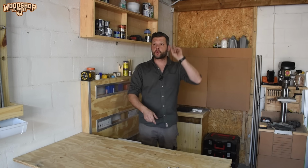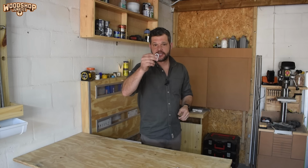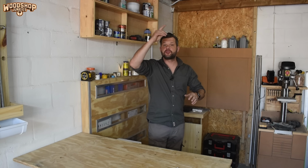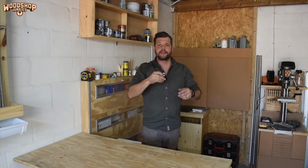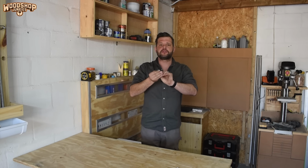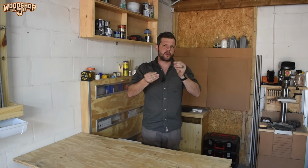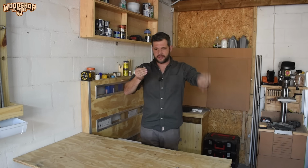To tie the extension cord to the overhead support system, I'm going to use these mini carabiners. So I'm going to add, let's say, 6 or 7 to the overhead steel wire rope, which will be able to slide up and down. Then every, let's say, 800 mils of extension cord, I will tie it to a carabiner with a zip tie or cable tie. So I will make an 800 mil loop, tie it to a carabiner, then another 800 mil and tie it again. So the cable or the power cord should be able to extend and compress or retract, kind of like a big slinky.